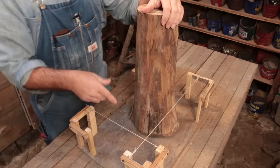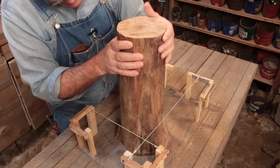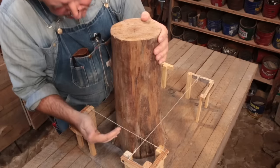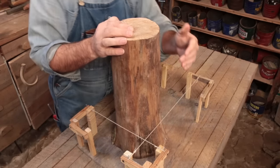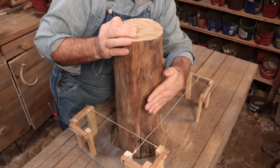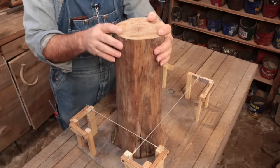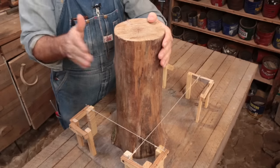Now, a corner presents another problem because you've got two planes to worry about. So you're going to want to set this pole, even though the core might be pointing outward just a little bit, so that this plane on this edge is basically plumb in this plane, and then this edge is basically touching the string and plumb on this edge. That way you make sure that these two planes where they intersect are basically plumb on these two edges of the pole. But again, it means that the pole is maybe slightly pointed toward this corner. But that will take care of your problems.